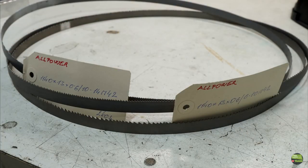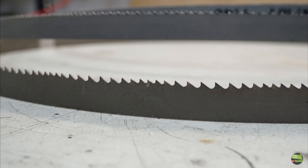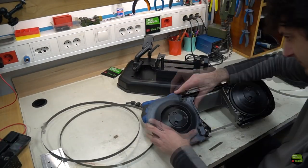You can see there's quite a big difference between them. All bi-metal saw blades are marked by how many teeth per inch they have — but why are there two numbers? Because the density of teeth isn't uniform. You can clearly see that some teeth are bigger and some smaller, because some teeth cut the material better and others clean the surface better. Now let's try them out.